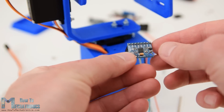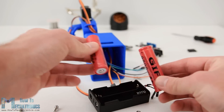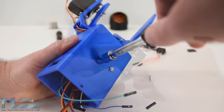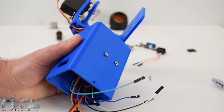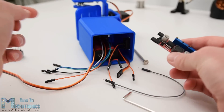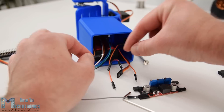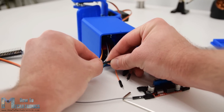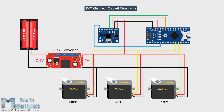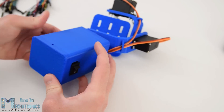Once finished, I passed the servo wires through the holders' openings to keep them organized. Then I inserted the MPU6050 sensor and secured it on the base with a bolt and nut. For powering the project I used two lithium-ion batteries placed in a battery holder, secured to the base using two bolts and nuts. The two lithium-ion batteries produce around 7.4 volts, but we need 5 volts for powering the Arduino and the servos. That's why I used a DC to DC buck converter which converts 7.4 volts to 5 volts. Here's the circuit diagram of this project showing how everything needs to be connected. At the end I squeezed the electronics components and wires into the base and covered them with a cover at the bottom.